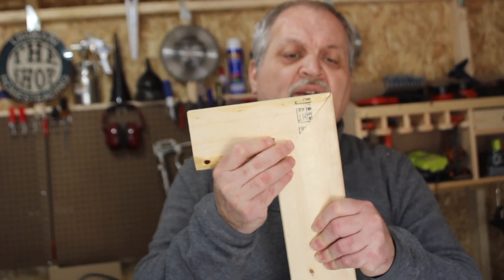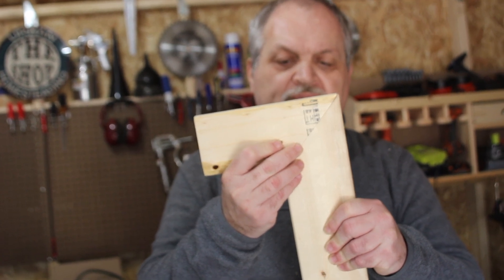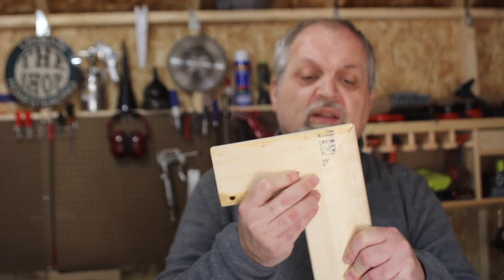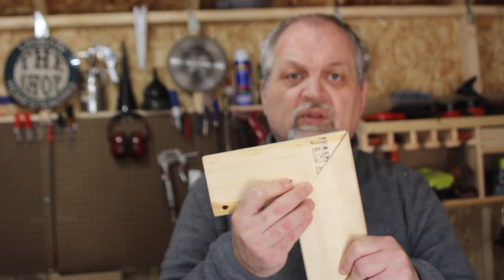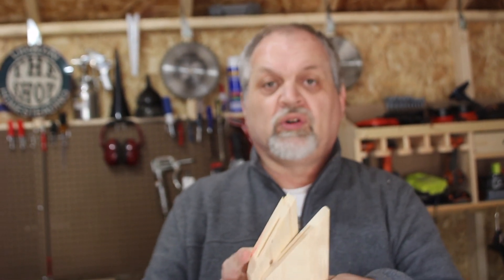The tool for a miter connection is the miter saw, though we have also done many of them on the table saw. You can use the miter gauge on the table saw — that's why it's called a miter gauge, it makes miter cuts.